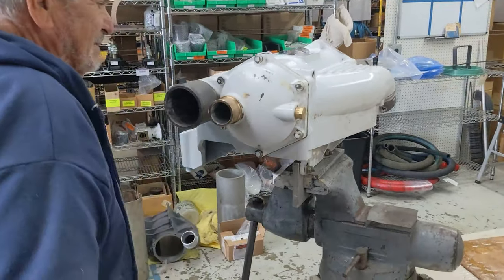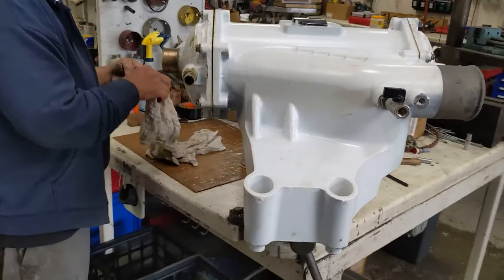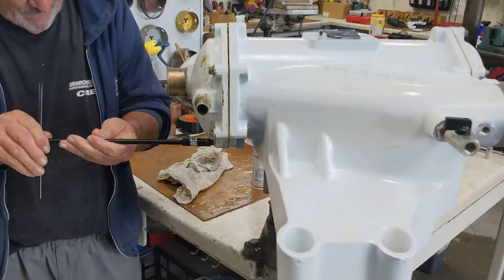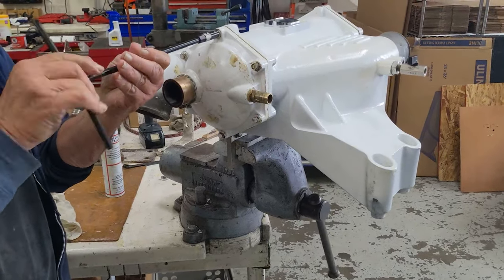Okay, and then we'll tighten up the bolts on the other side the same way, and that's how you service a QSB 6.7 high output or older style derated aftercooler, not the slimline. Okay, I'm seating him right now. There's one.